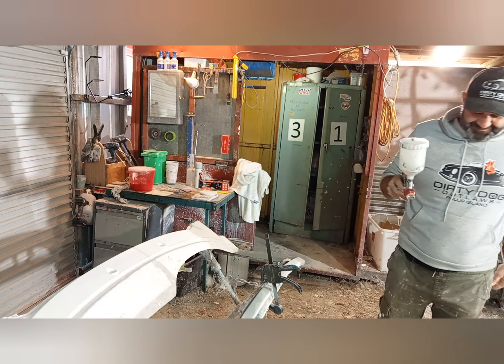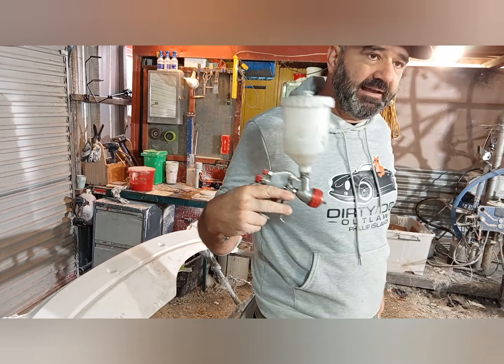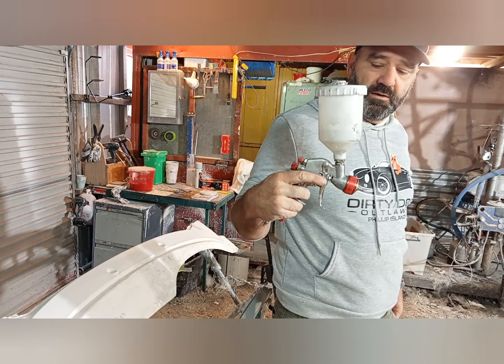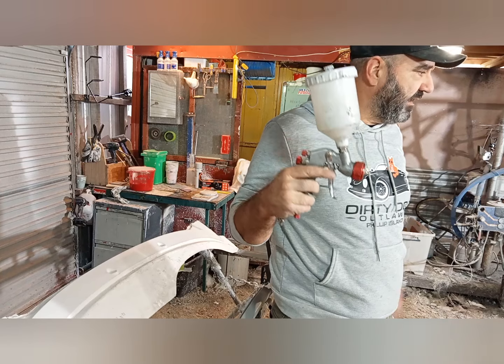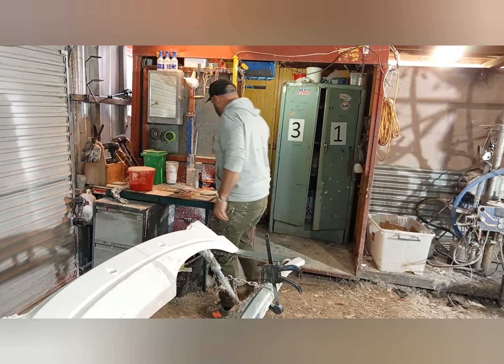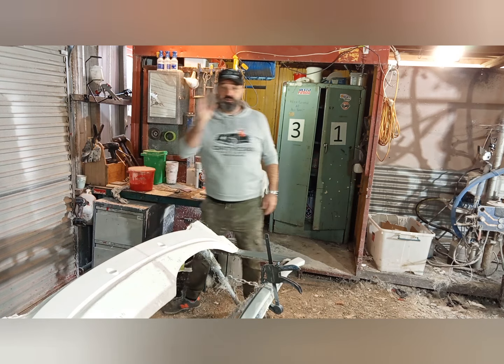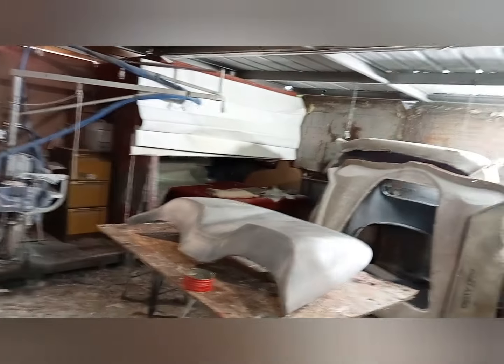Alright, so Dave set up the gun, I'll be honest. So Dave set up this gun, and in here is the PVA, and that will spray on in a minute. So what I'm going to do is give this another wax. Right, I'll put this up here. I want to give that another wax, and then I'm going to spray that PVA. I'm going to go for it, man.